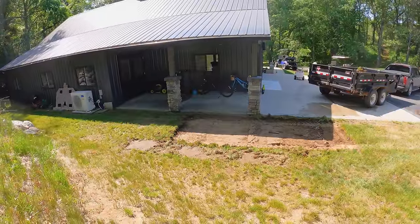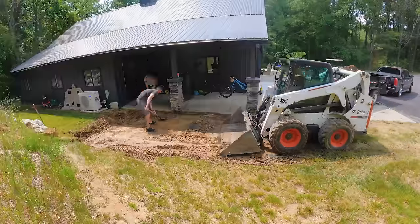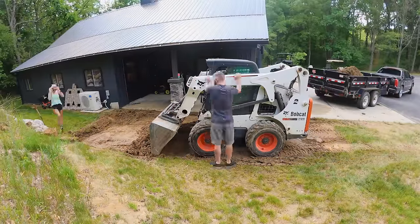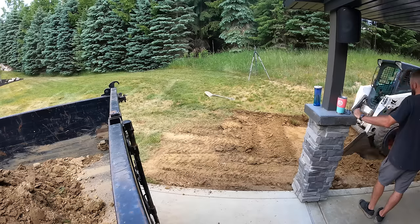It did work well and we were able to get out all that soil and get it down to about eight inches — a minimum of eight inches — to allow for the base material, the pavers, and that top coat that is in between the two.